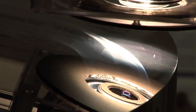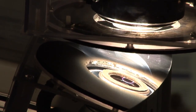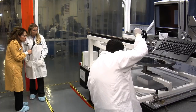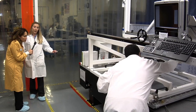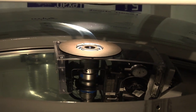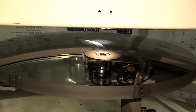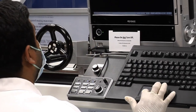Now that we've seen the primary mirror, I'd love to show you the secondary mirror. We are performing a microscope inspection of the surface — getting very close to the optical surface so that we can capture surface data to look at later on. You can see this one is unique compared to the other mirrors: this one is a convex hyperbola, whereas the primary mirror and the tertiary mirror are all concave.